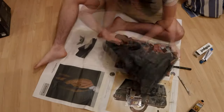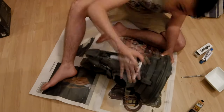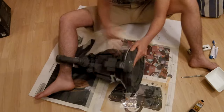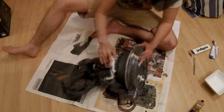After that it was time to close off the little gaps and imperfections on the gun. I used Milliput for this process, let it dry, and then used 80 grit sandpaper again to clean the surface from the excess Milliput. I then cleaned the surface again to remove the dust so I could apply epoxy on top.